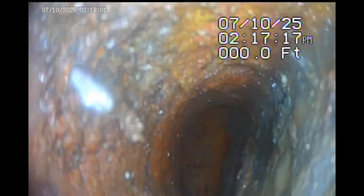What I would strongly recommend is, before that basement bathroom is finished, you want to clean out this section of pipe. I believe this is just a branch that's going to hit the main line going out, the lateral line from the house. So this doesn't get a lot of flow through it. Potentially it's just that bathroom, and here's where we connect up.